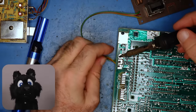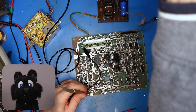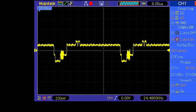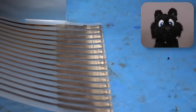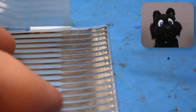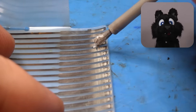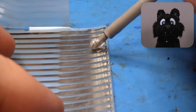After connecting up the power supply again, the next logical step was to check for a video signal, and indeed I get something that looks like a proper PAL output. Now the keyboard connector was oxidized, so I decided to give it a good scrub and promptly found out that two of the traces were a smidge thinner in one section. A quick repair job with some conductive paint should do the trick.